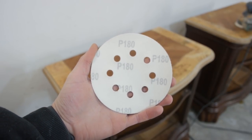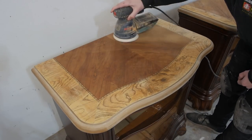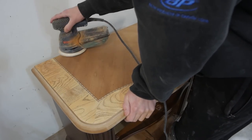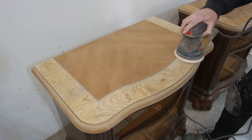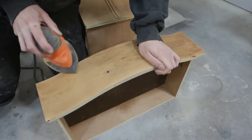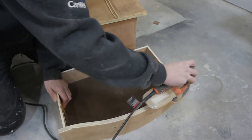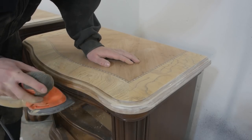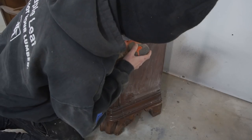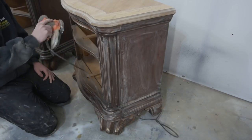Before it's fully ready for stain, we're going to use some 180 grit sandpaper and sand the surface clean. Since the veneer is super thin, we need to be really, really careful that we don't go through it when sanding. I'm using 220 grit with my detailed mouse sander on the drawers, and I lightly went over the edges as well. I also sanded down the entire project with 220 just to give it a better surface so the paint will adhere a lot better.